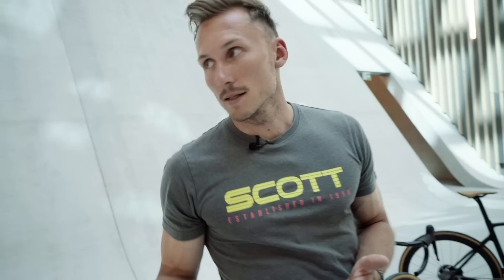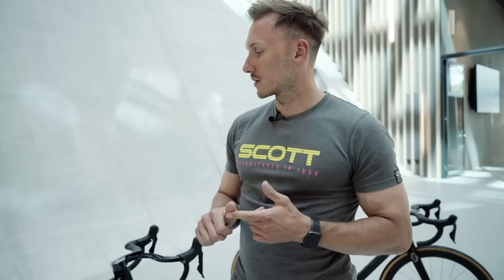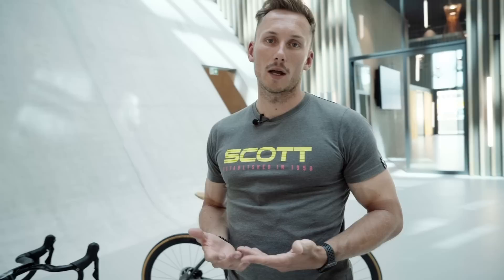The same approach was followed on the front fork, making it a 100% hollow structure. Regarding details, the new super-minimalistic seat clamp weighs just 12 grams. This is light, but it doesn't stop there — we also significantly reduced the weight of the seat post. Compared to an equivalently shaped seat post, we were able to save 66 grams in the seat post and seat clamp combined. This is what, in our eyes, provides the perfect road bike for road bike racing.